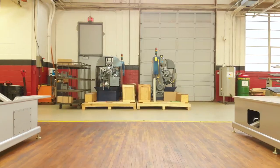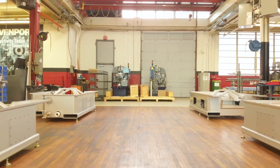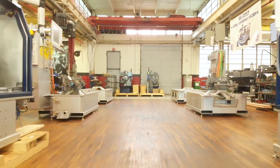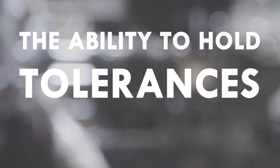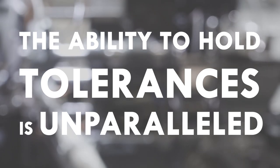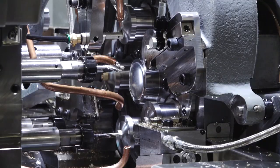The hybrid machine represents, to Davenport, a future that blends the best of the past with the best of the future. The ability to hold tolerances on this machine is unparalleled compared to our older platforms. Its ability to make high quality parts in very difficult materials — now you can run with A286, some of the heavier alloys, and stainless steels that typically in the past weren't able to be done on a Davenport machine.